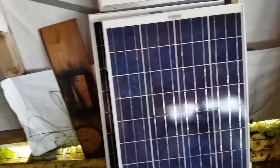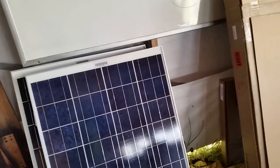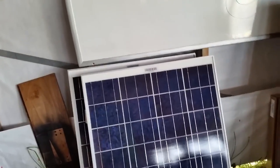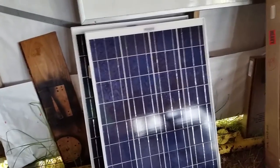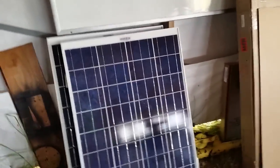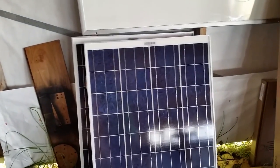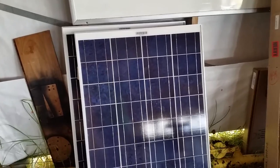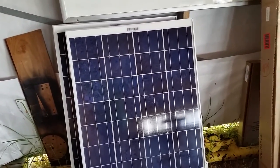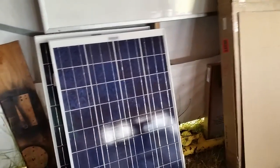What I might end up doing is using two 100-watt solar panels with one 50-watt solar panel, giving 250 watts of power going into the golf cart batteries. Either configuration could work — you can always add more or less. But if I can get away with two 100-watt panels and a 50-watt panel to hit the voltage I need, I might be okay. Then again, the amperage might be a little too low to keep those batteries charged, so we'll see what happens.